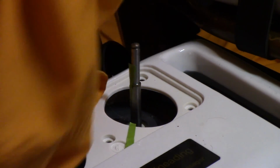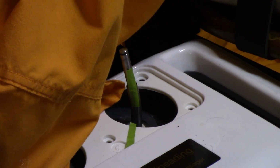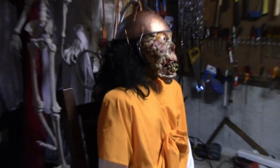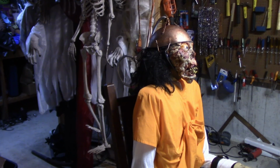I've run this a couple of times, and getting back to center every time, so that's perfect. I'm just going to take that, duplicate that sequence and invert it so that it goes the opposite direction. As long as I keep those sequences the right length, I should be able to get the prop back to upright, which is where he is now.